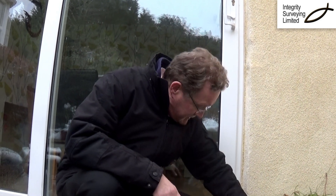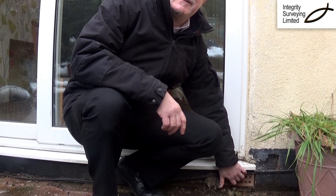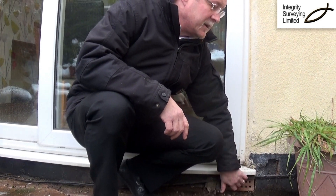Now if you've got a house with timber floors, have a look at the air vents and make sure that they stay clear. If they get blocked then rot could occur after a time, and you can always just get a needle or something like that and push it through the holes so that it clears them. Just give them a check every now and then.